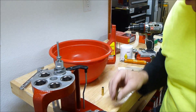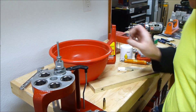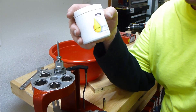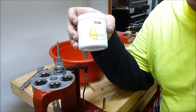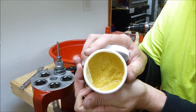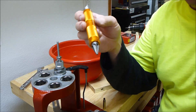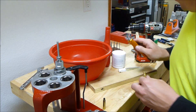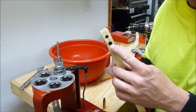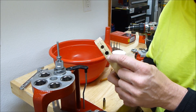I did this two different ways. First, I tried lubing and resizing some cases before cutting them to length — that was a bad idea. The lube I'm using is isopropyl alcohol in high concentration, mixed with what's claimed to be pure anhydrous lanolin. It's a thick, gelatinous gunk — very good at lubricating cases, but it leaves them sticky. So all the little metal shavings from trimming tended to stick to them. The other problem was that lube got into the bore of the jig, making it easier for the cases to spin, and going against the bandsaw blade you don't want that — it can cause the case to roll and overfeed into the blade.